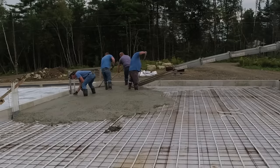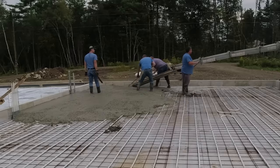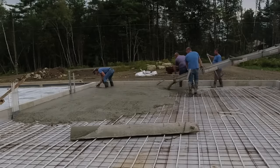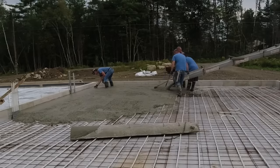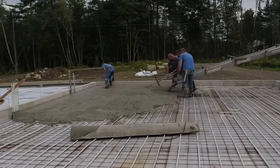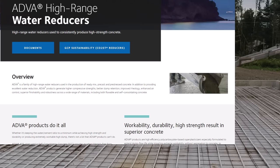They just see concrete and think, oh man, that stuff's wet, you're just going to weaken it. We know you can't pour wet concrete and we don't know why you're pouring it this wet if you do it professionally. So I'm going to give away the secret right now, guys. It's called water reducer. It's an admixture. They batch it into the concrete when they load the concrete trucks.